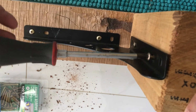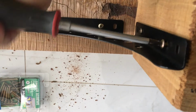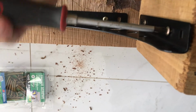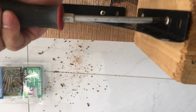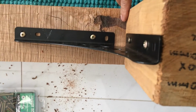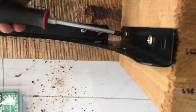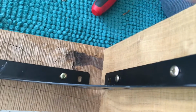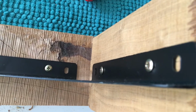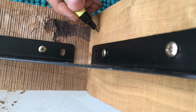so once you drill all your holes, you run your screws, make sure you are screwing them straight. Okay, that's very important. And then this is only assembly, so for assembly it has to be all fair and square, very important. Okay, and then we do the marking because we're going to disassemble, so I would call this as A.